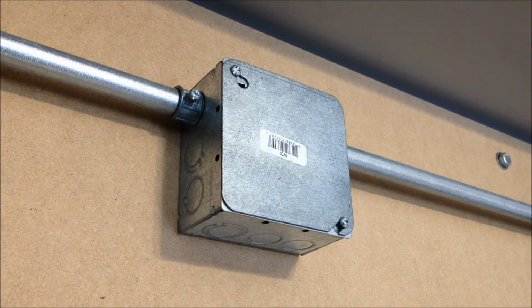So behind the blank plate on the second box over here is a model number 4905-9938 SmartSync adapter. Essentially what this does is it takes the two NACs from the SXL-EX and converts it into a 2-wire SmartSync output to drive the chime strobe over on the first box.